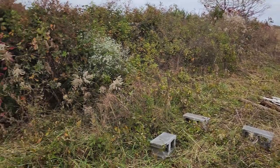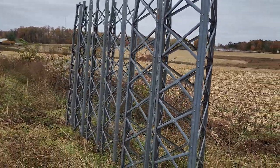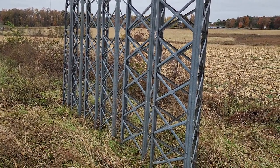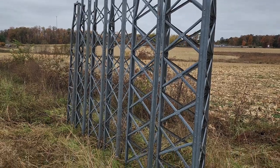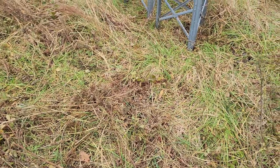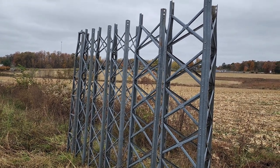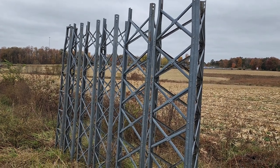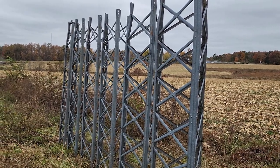So what kind of tower? This kind of tower. I've put these up on their feet, but normally these would be laying down in the grass. This is basically six sections, eight feet each, so around 48 feet when it's all said and done. We've got to dig a hole for it somewhere in this general location, and probably a yard of concrete somewhere in that ballpark. He's the expert, so he'll be telling me what we're going to do.